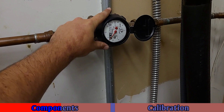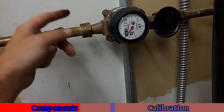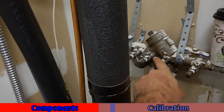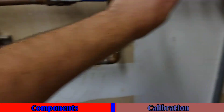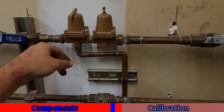This is a flow meter where you can monitor your flow through the regulator. Most buildings nowadays have this, not all of them will though. Then you come over here to your RPZ — it's a double check backflow preventer with a vent. On this particular loop we wanted a 10 psi setting.